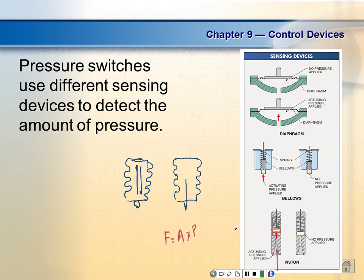How do we get this into motor controls? Well, we'd need to put a contact on top. Just about all of these sensors are combined with a limit switch. When the rod comes up it hits the limit switch; when it goes down it releases. A lot of these sensors are combined with another device to actually create a usable signal. For example, our grinder's lube system has a piston with a limit switch on top — a push-button limit switch where the piston pushes the pin up into the button.